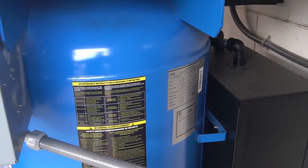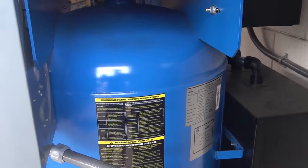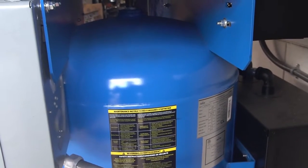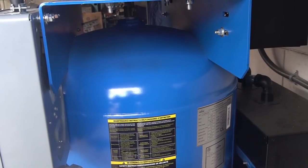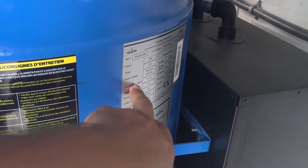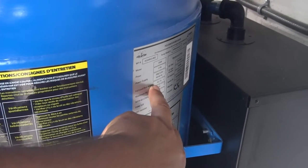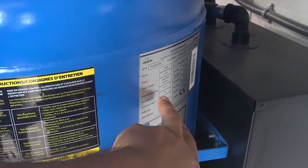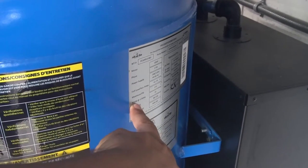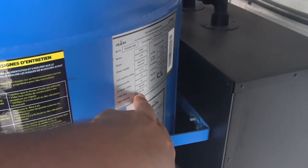On the back side is a spec sheet — a silver decal. On their website, looking at the model I bought, this is the 80-gallon QuietAir compressor. They claim 50,000 hours of industrial use with proper maintenance on these pumps. This one is rated at 38 CFM at 100 PSI or 34 CFM at 175 PSI. The spec sheet says 10 horsepower, single phase 220. I have a 60-amp breaker sub-panel ran to this one. Maximum is 175 PSI, and the weight is 848 pounds.